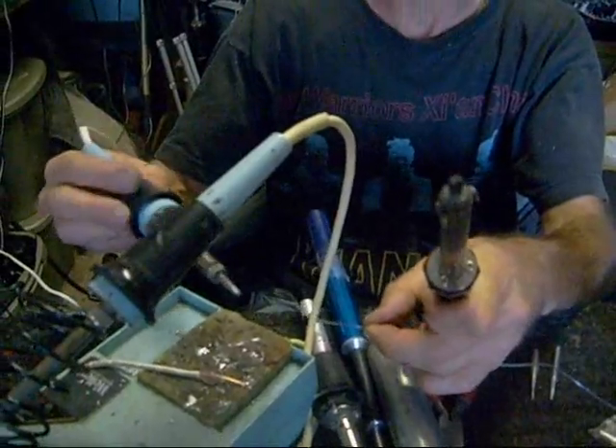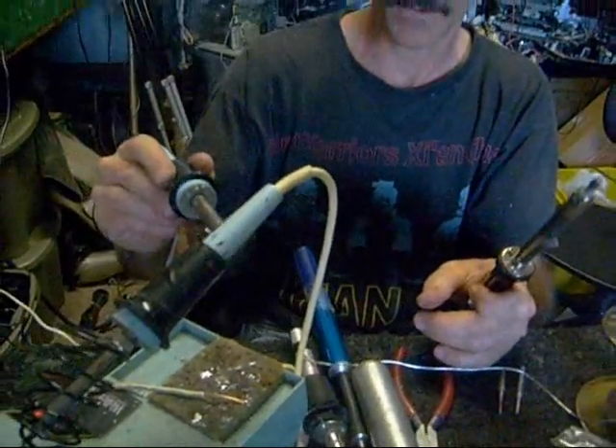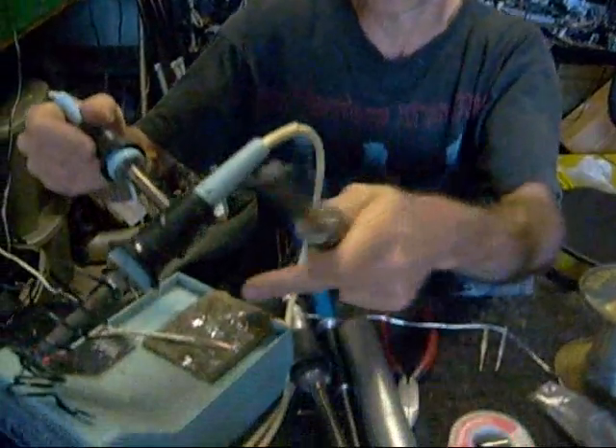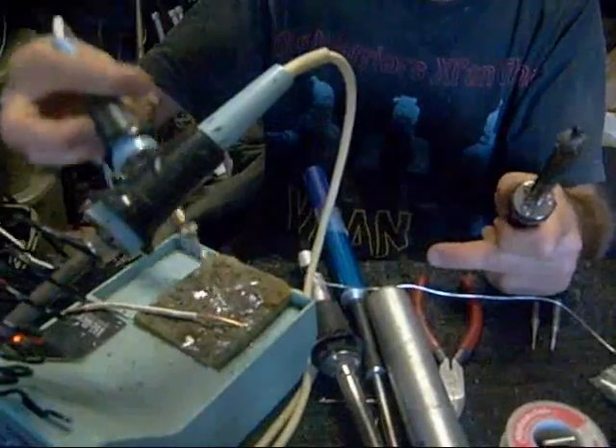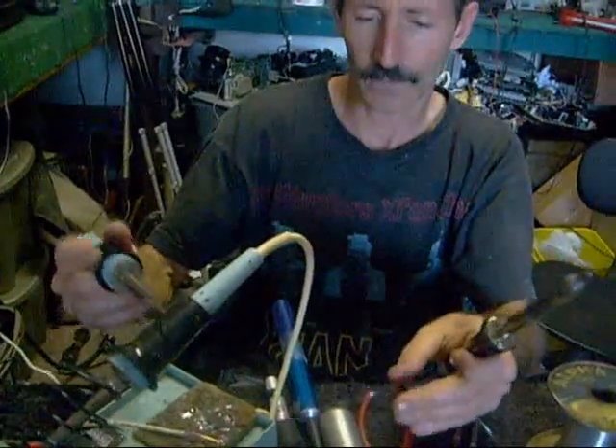Of course, I can shake it off like that, but it's very useful to have a soldering iron tip where some of the solder actually stays on the tip. From time to time you need to clean it when you're using it. With a wet sponge, you can just take it and roll it in your sponge a couple of times, give it a couple of taps, and you're ready to solder.